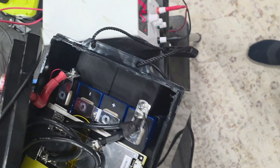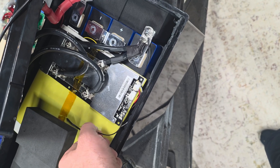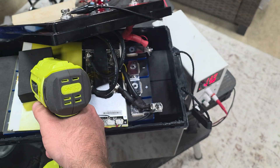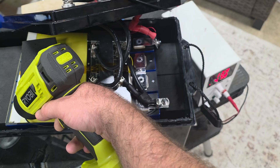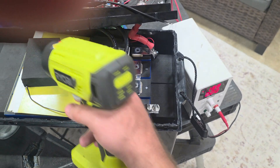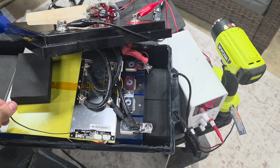I've got a heat gun here and the temperature sensor, which isn't actually on the battery — it's just taped to this piece of fiberboard, so it's not touching anything. If I turn the heat gun on and aim it at the temperature sensor, it could turn off. There it goes — it turns off. It seems to recover pretty fast, just a couple of seconds.